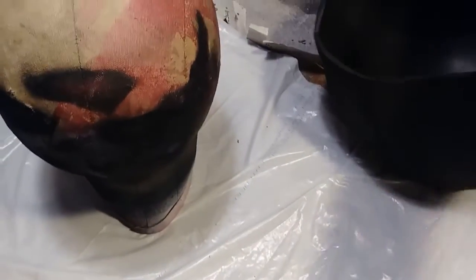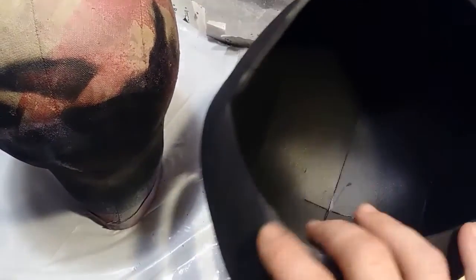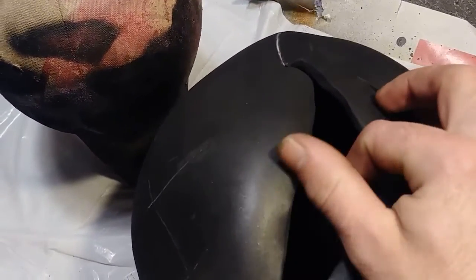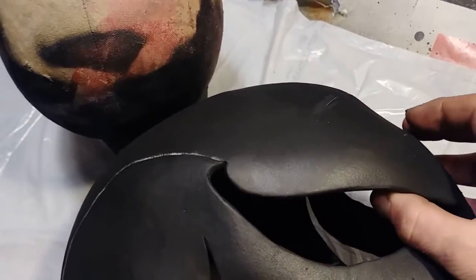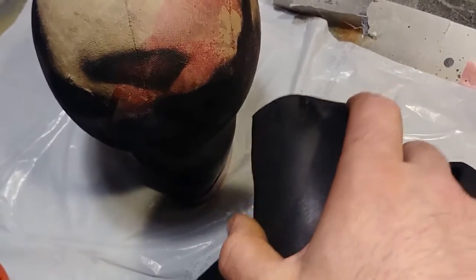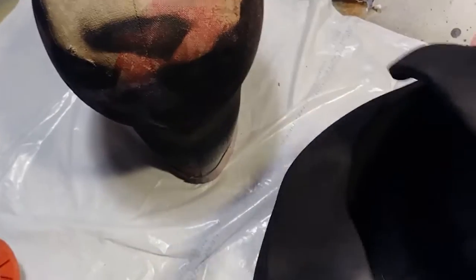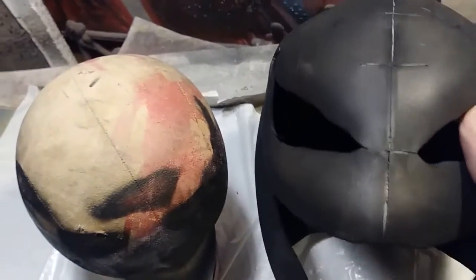The jaw itself, in a broad sense, I did heat and round out, and I pulled it out here but pushed it in along this back side on both sides, and rounded off each side of the jaw as evenly as possible, and put a little bit more curvature and fold on this going inwards, and put a little bit of a dip in here just to kind of give it a brow forehead ridge differentiation. And then on the bottom, had this come in just a little bit here and squared it off slightly here on the end, and heated the mask thoroughly on the inside and just kind of squeezed it in just a little bit to get less of a round shape out of it.